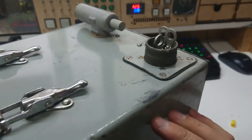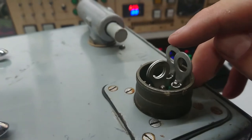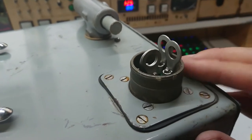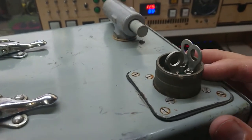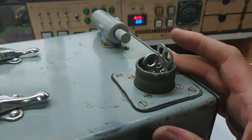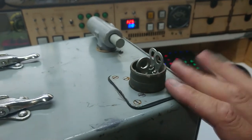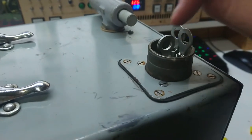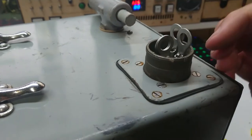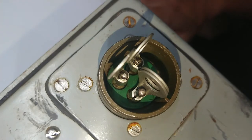The next job is to test this. I pulled the little insulators off some crimp terminals and I'm going to improvise a couple of connections until my plugs arrive. I did find plugs and found the part numbers — I'm importing one from the UK and found a couple of connectors from ITT Cannon, which manufactures the plugs used in the ambulance. I'll put all those part numbers in the description. For now I'm going to solder these terminals together in such a way that I can still connect some wires to them.